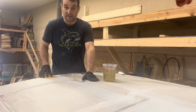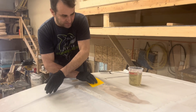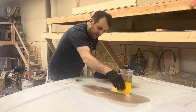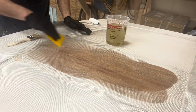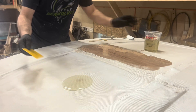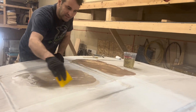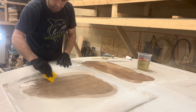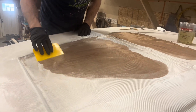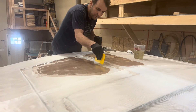On six ounce glass like this, you just start pouring little dabs. You can see all the ridges of the filleting — I'm going to have to work around that. I'll start clearing and you can see right here how it's starting to get clear. This is not a very thin epoxy — we have a three-to-one that thins better, but this does soak. It's only about 800 CPS, so it doesn't soak in like some clear laminating, but it's a good general purpose. You can see how all of this is starting to wet out — just take your spreader and work it around.